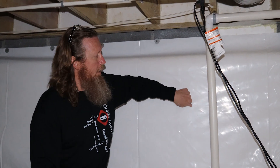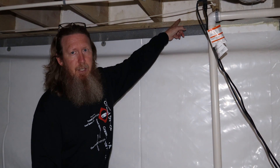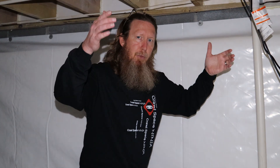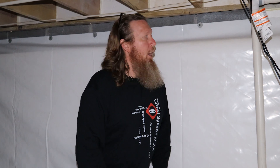We use our R10 termite-resistant foam board to seal the vents and put insulation behind the plastic, and it's also great for rim joist insulation. This is a very efficient crawl space — we've got code R10 foam board, all the vents sealed, and rim joist insulation. According to buildingscience.com, the stack effect inside the home causes air to move up the walls and out of the crawl space every time the AC kicks on. Rim joist insulation will help eliminate a lot of those drafts you feel inside the house and is a great investment. Some companies will spray foam the entire rim joist, but we don't like that — it's messy, and if you need to access that area, it's just easier to pop out the foam board.